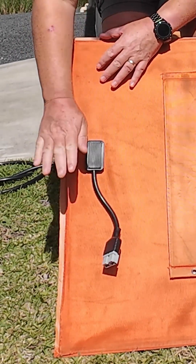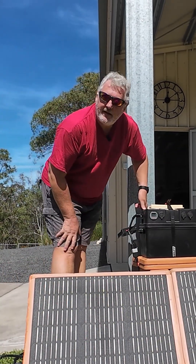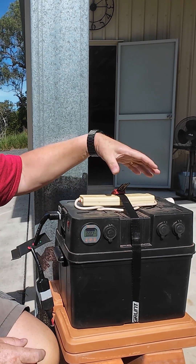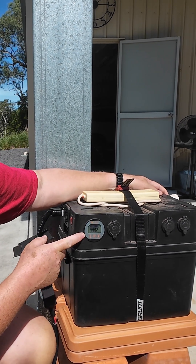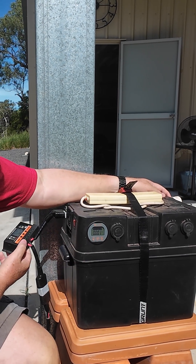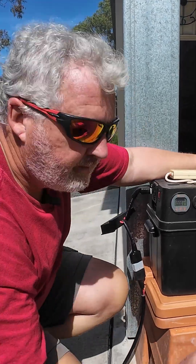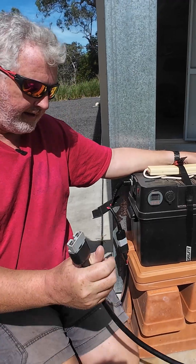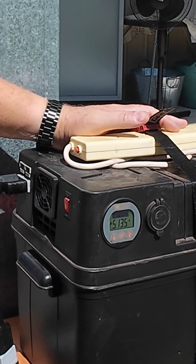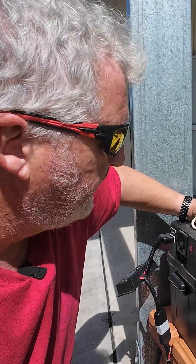All I've got to do now is just seal the ends. Behind me I've got my portable lithium battery — it does have a small 500 watt inverter built into the top, hence the reason why I've got a power board sitting on top of it. I've got a shunt inside as well so I can see what's going in or coming out. And I've got my iTech World regulator, which seems to do a reasonable job. So if we now connect the solar cable from the regulator to the panel, we've got 5 point something to about 6 amps — not too bad off of what is effectively a 120 watt solar panel.